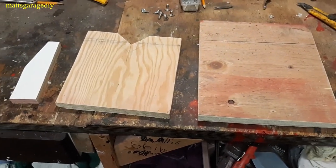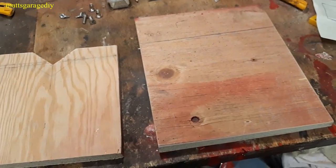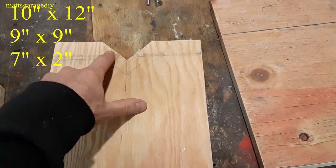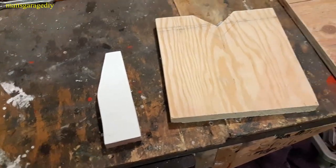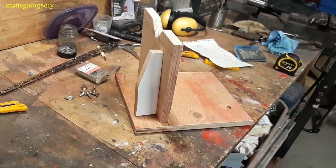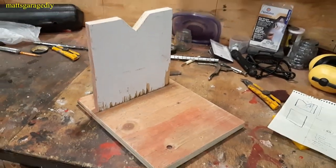I'm wanting to make this thing as cheaply as possible. I started by digging through what I had for scraps of plywood. I'm using, I think it's all three-quarter inch plywood — definitely a half inch would work as well. Cut three pieces. This first piece is 10 inches by 12 inches. This piece is roughly nine by nine with a notch cut in the top, roughly two inches per side, and then just a little piece that we're going to use as a support — two inches across the bottom, about seven inches up the back. I've just placed the three pieces together — this is roughly what the stand will look like when it's complete. I'm gonna use a couple hinges, maybe a little bit of leather to trim up the V notch where the pistol rests. And if you're real fancy, maybe even use a little fence paint.